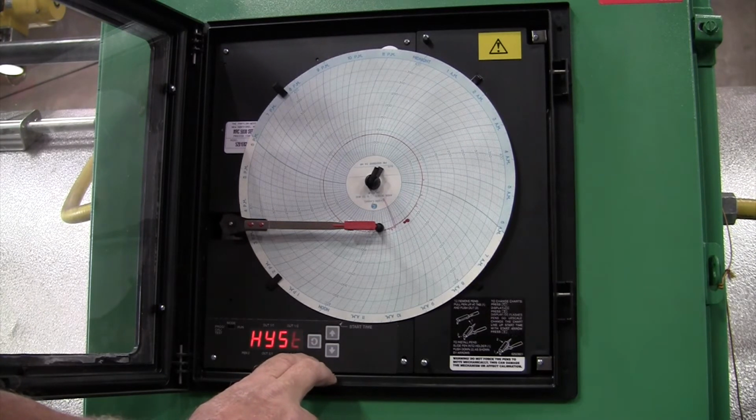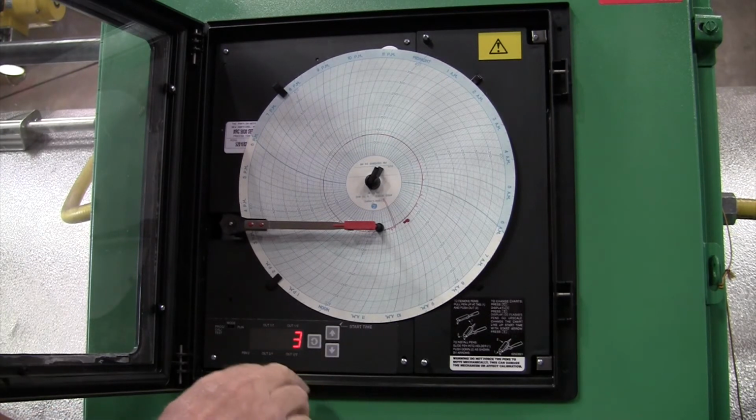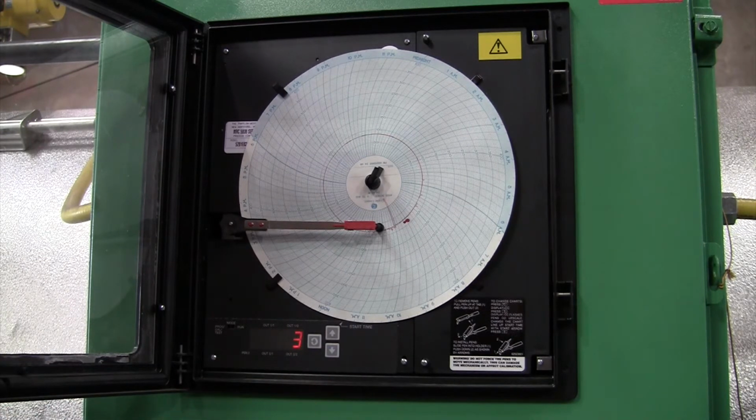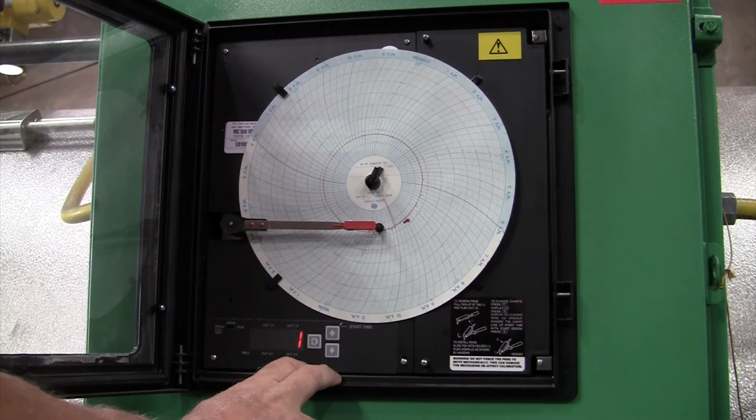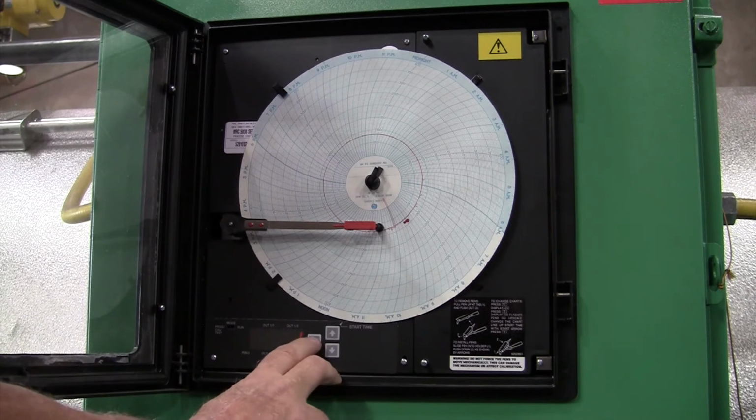Next, this is for how quickly the inlet valve modulates. So the lower the number, the quicker it's going to open and close, because it'll do it shorter. 3 is about a 3-degree difference, 2 is 2-degree, 1 is 1-degree. We find 3 is just about right. DFF, that's always at number 1. I don't have a real good explanation for what that means, but it's always at number 1.